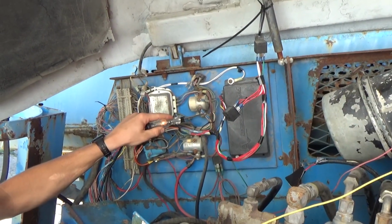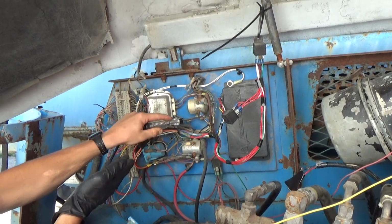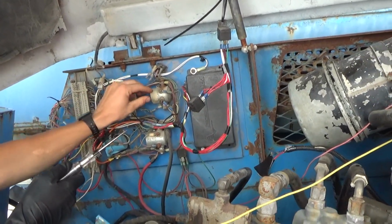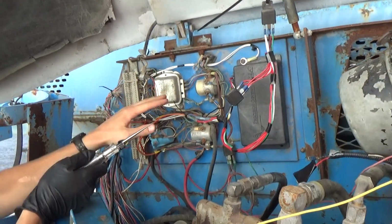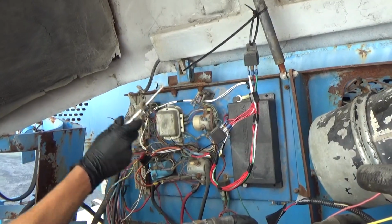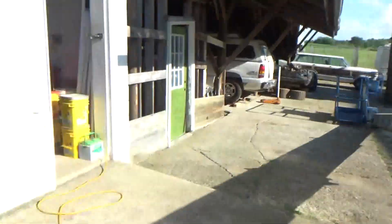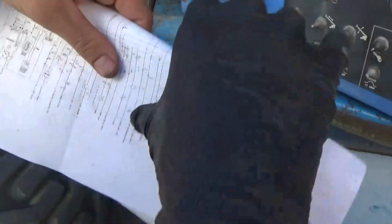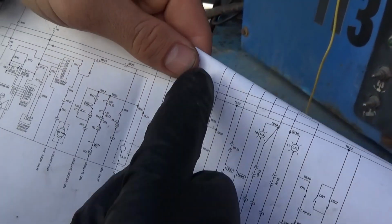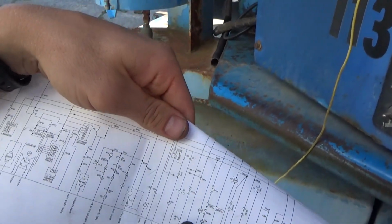So crank it. You actually can feel the relay click. So it shuts off. Why does it shut off? Now let's go for the control side. According to our diagram, which was here, the control side on PR1, one side is constantly grounded, the other side is either a power feed, or when it loses the power feed, then the relay shuts off.